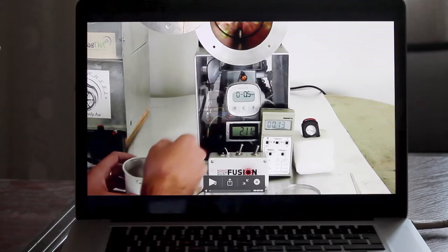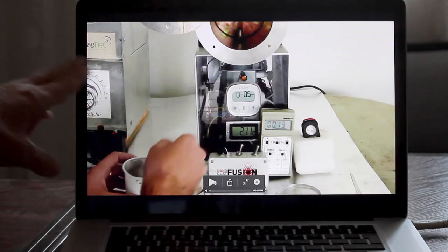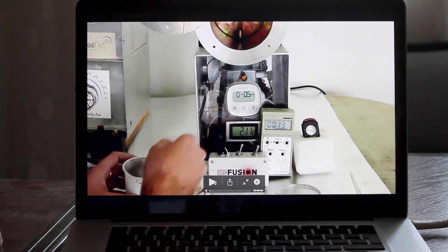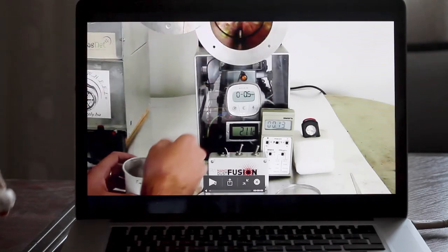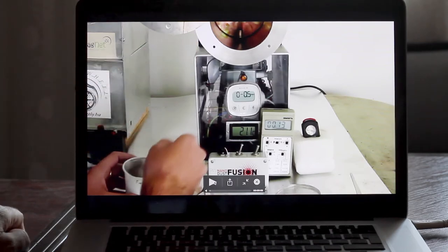And this is Mark III, but it had a very crude electromagnetic cavity resonator, and some of the microwave radiation just seeped through the opening. It was not a perfectly done device, but this was our first cylindrical electromagnetic cavity resonator, which was quite efficient. Even the length of this periphery or perimeter had to be designed to nearly lambda quarter. Then there is very little loss of microwave energy. So these are very important technical details of the know-how. It took us 3 years to figure out the best devices.